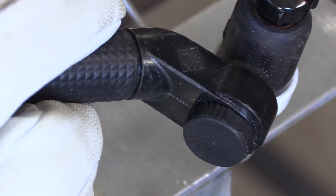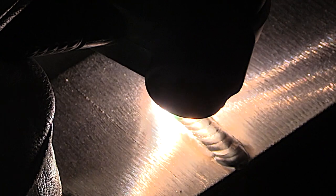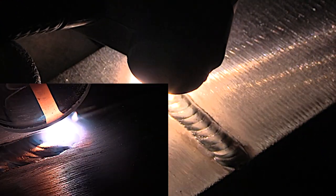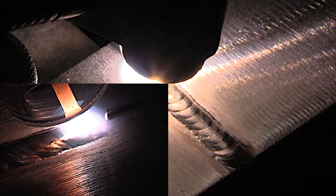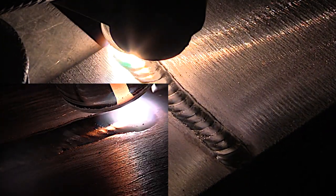Let's look at a bead on that real quick. Aside from me flopping the tip of that filler rod all around, it's welding pretty clean. Nice shiny puddle, not a whole lot of crud floating around in there. No black soot, no pepper in the puddle, no brown haze surrounding the puddle from stuff cooking out. That's kind of what you want to see.